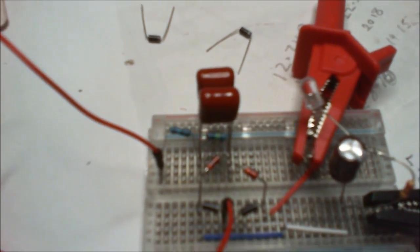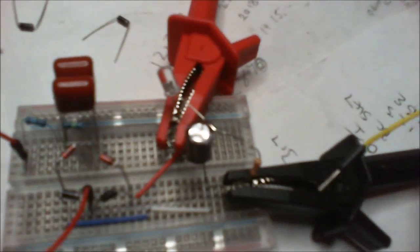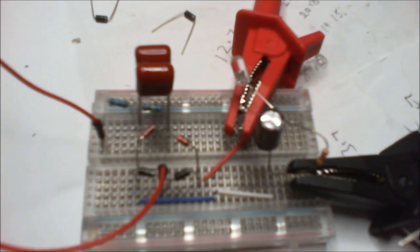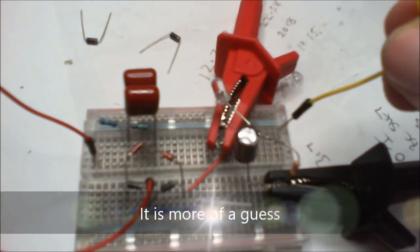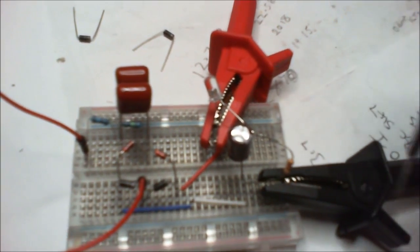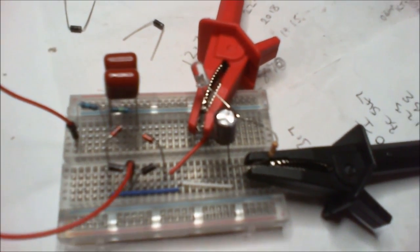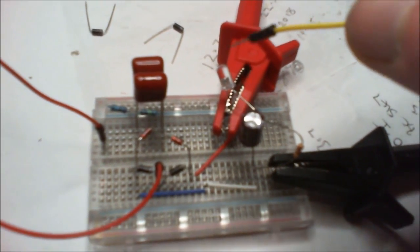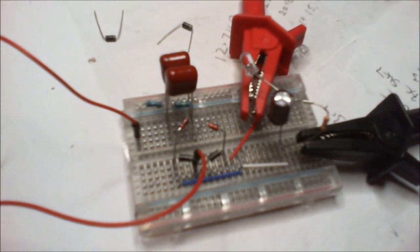No, it was about 12 volts when I was using these wires and not connected directly, negative side to the resistor here, the load, and the positive side to the LED. I think the reason is that with these connections and this socket, the resistance goes up because of the extra connections not being very good. So I've dropped the resistance now across this, and we're down to sort of 10 volts. I'm sure the milliamps will have changed as well, so we'll do an amperage check on it.